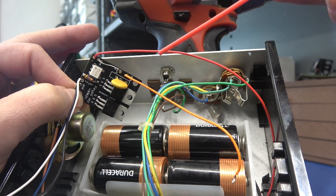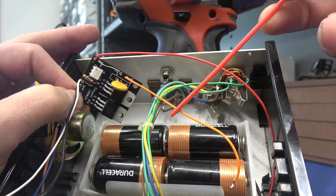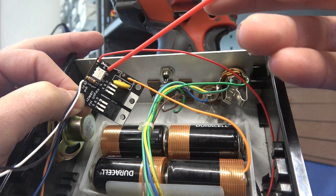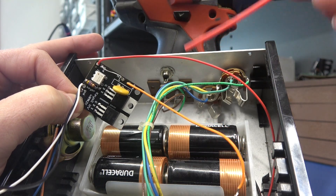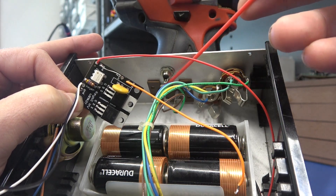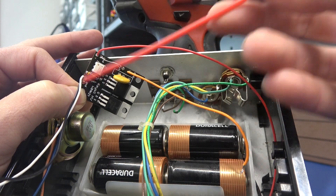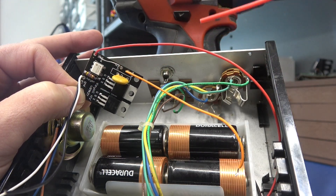The red is the switched 6-volt DC. The orange is the output of the KEYALL module. Output 2 is actually strapped to ground, because I'm sharing the ground with the transmitter through that chassis mount RCA jack. Then we have the white, which goes to the direct output RCA jack, and the black being ground.